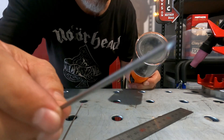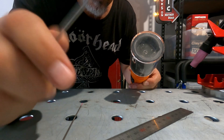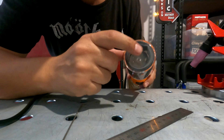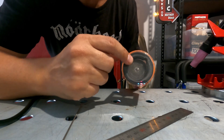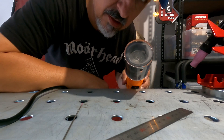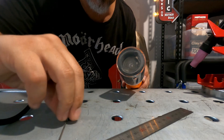There you have it — that's a 30 degree tungsten grind. And that's starting to feel a bit warm. But the beauty is this cap keeps all that dust in there, so you're not breathing that in — especially if you're using the thoriated tungsten, which is a little bit radioactive. So there you go. That looks pretty good.